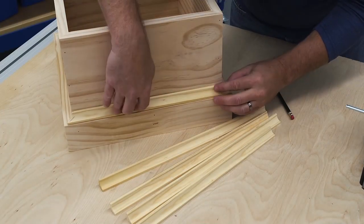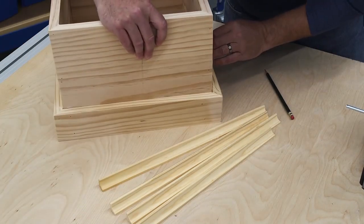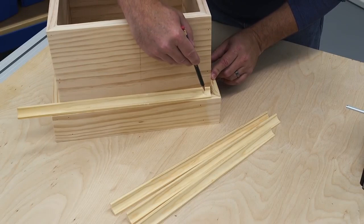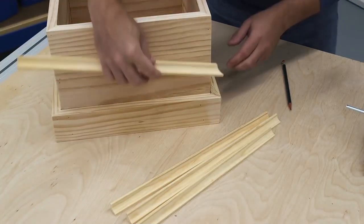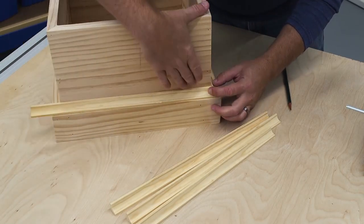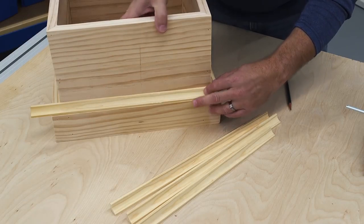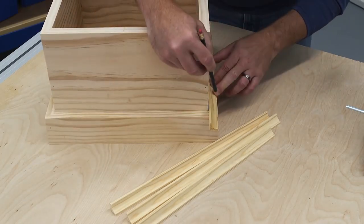After cutting, put this piece in place and use it to fit the next one. Just start by cutting the miter on the end that fits against your first piece of molding. Hold the second piece in place against the first piece, making sure that you line up the corner tightly. Then you can mark the other end and cut it to fit.